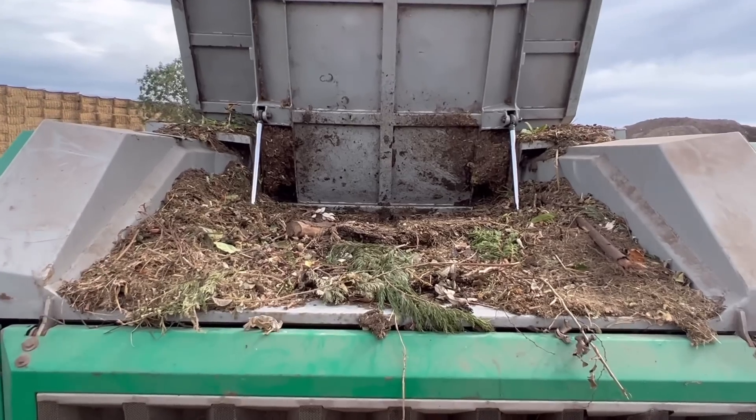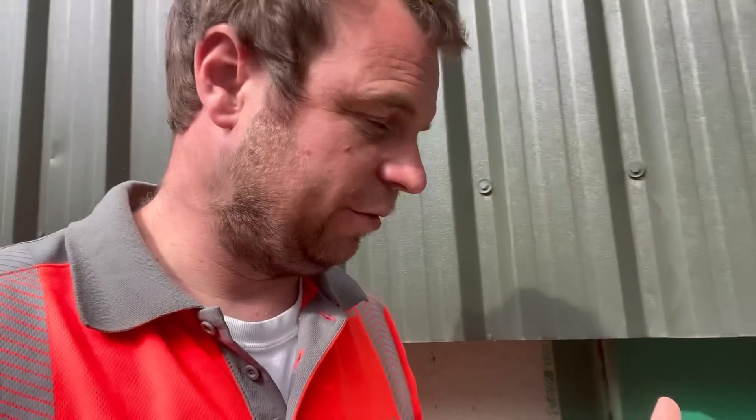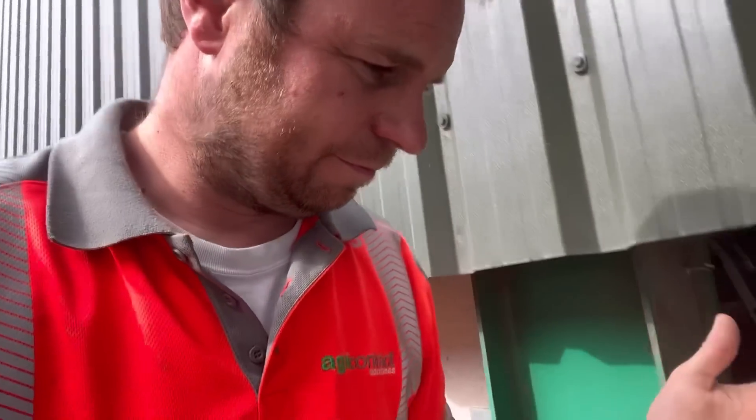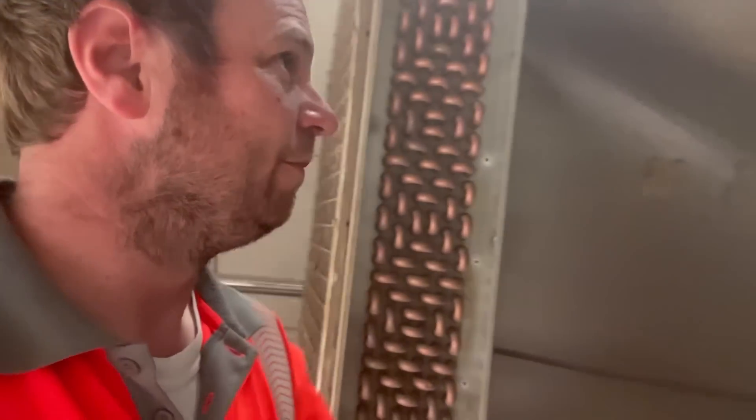That's a job for tomorrow when it's all cooled down. There's a bit of dust in there but I'm going to show you something — the big fan in there, the radiator is getting a little bit blocked so it's sucked in the cowl, which turns it from a square hole to a round hole. Rob's unbolted it so that we can get inside and pull it out, and we're just blowing the heat exchanger out. There's loads of dust so we've turned the fan on to create a bit of draw to pull the dust out — it's full of really fine dust, the kind that only sticks to galvanized paint. Let's clean it out now.